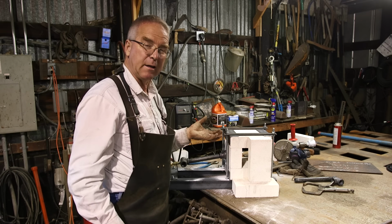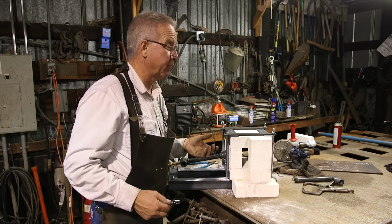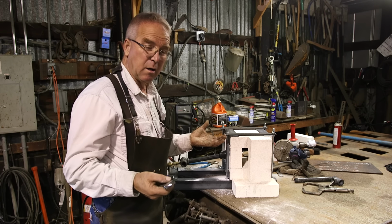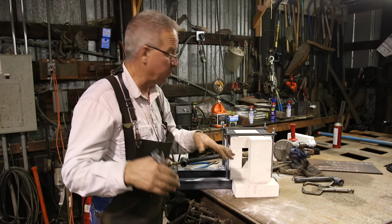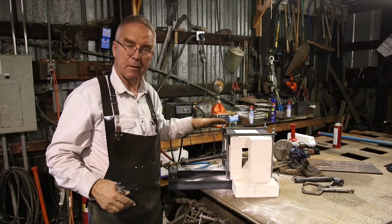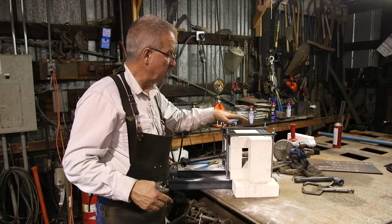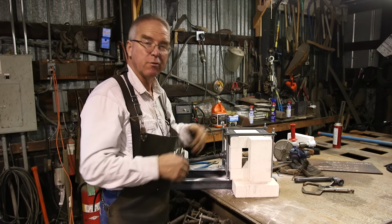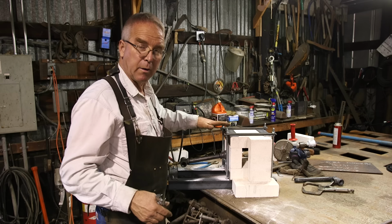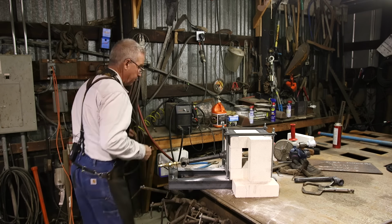If you've got a piece of plate steel, maybe a piece of expanded metal, shaker screen, anything that's not flammable. You don't want to try to put a wooden tray up here, but you can actually put a little table over the top of this, which makes your loss of bench space for your forge go away, because now you can put punches and chisels and tongs and stuff right here on top. Watch this.